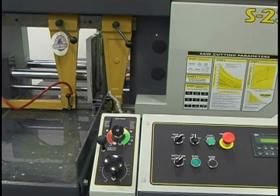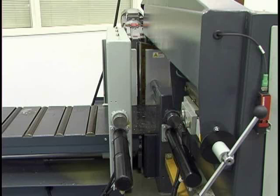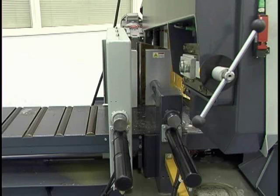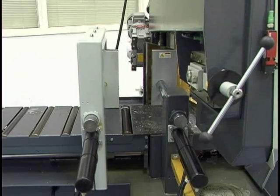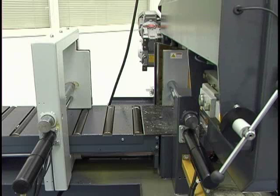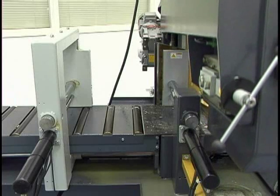If you put a large bar in the shuttle and needed 30 pieces, the operator could just let the saw run while doing a secondary operation. We're going to demonstrate the speed of the shuttle without material in place — the shuttle goes slow within an inch from its target, but you'll see the rapidness as it goes back for longer lengths. The shuttle has a 29-inch travel; with 15 inches programmed, you can see how it goes back quickly and then slows down when it gets to an inch from its target. It's clamped and ready to advance the material once the trim cut is made.